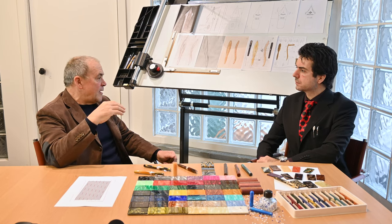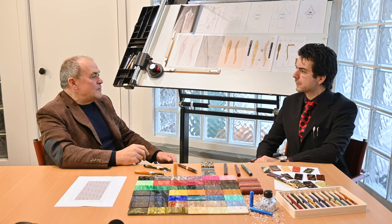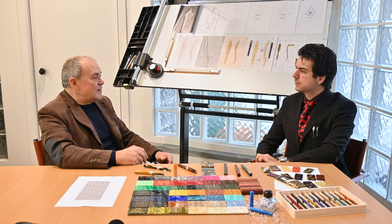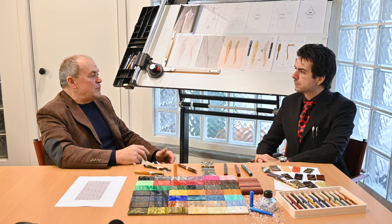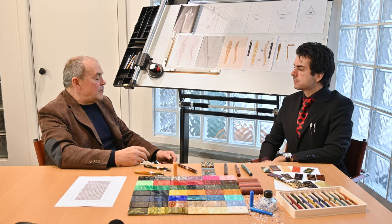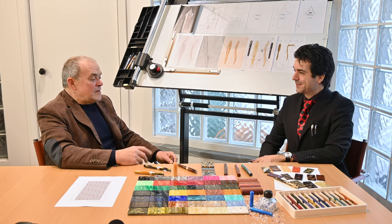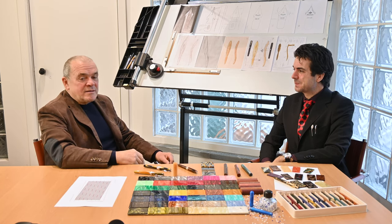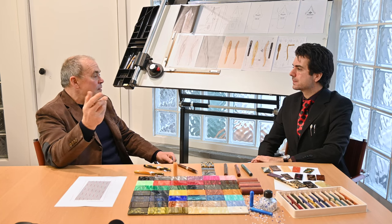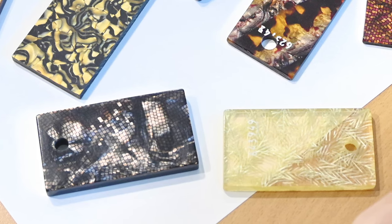But even at that time, like now, the makers of material were tricky. To speed up production, they ship us material with a higher percentage of alcohol. This makes the manufacturing difficult, the drying more difficult, and most of all, we can have shrinkage in the material. I was about to ask you. It's easy for everybody who likes celluloid or vintage pens: when you find an old pen with a loose band, this means the material was shrinking.